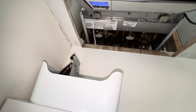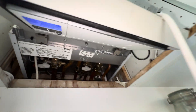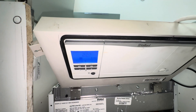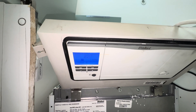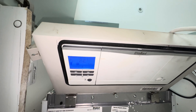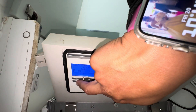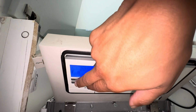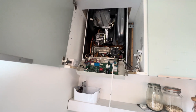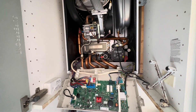We've now wired to the end of a plug and we have power - let's see if the boiler runs. I'm going to guess it's a fuse spur issue. The pump sounds like it's got air in it, but let's get the power off and change that fuse spur.